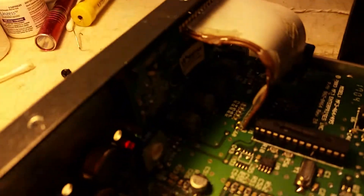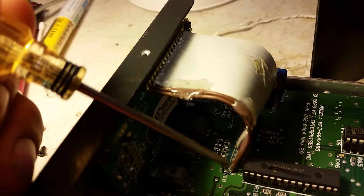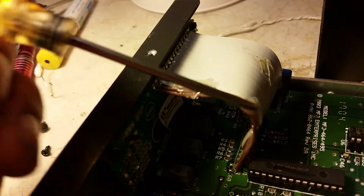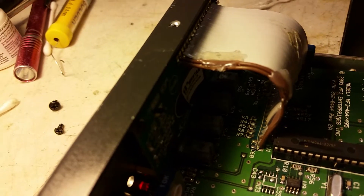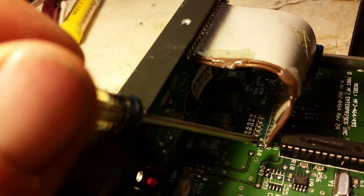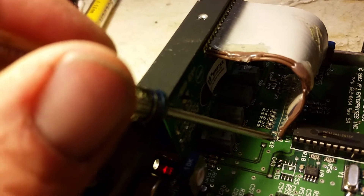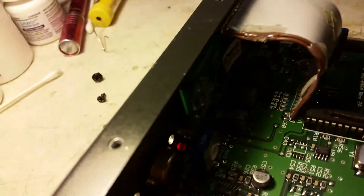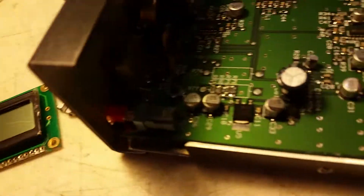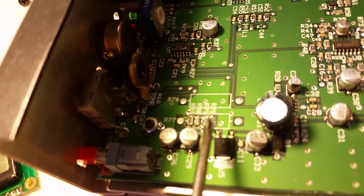Got the display put in. Had to add two extra wires here - pins 15 and 16 were not filled on the original, so I just soldered a couple of wires in there and hot glued them. And C60 - they didn't send us this capacitor, but I went ahead and added one, a 104, a 0.1µF, on the back side of that board there.